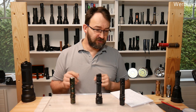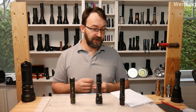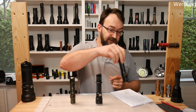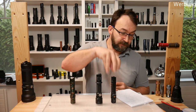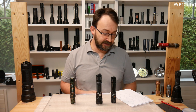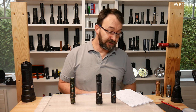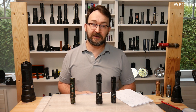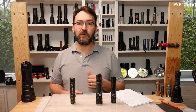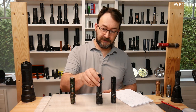On the throw measurements, I also repeated five times, I measured at 5 meters. Fenix, they claim 283 meters, which equals 19,977 candela. And I measured 21,575 candela, which calculates to 295 meters, a plus of 8%.